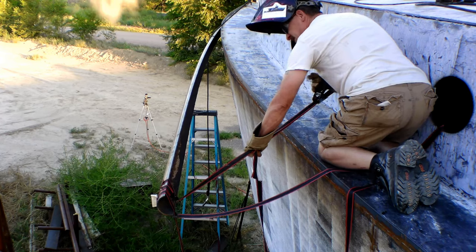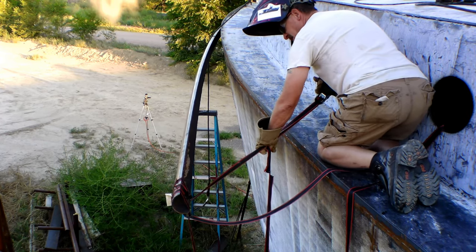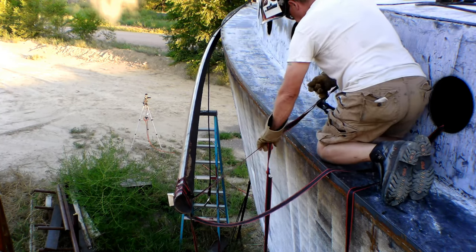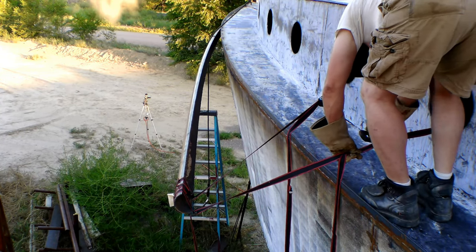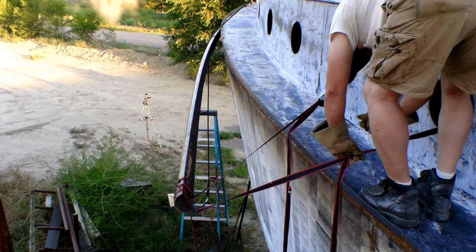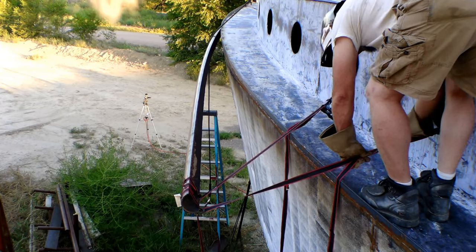What I ended up doing was tacking the forward end of the shear pipe to the bow, because that was going to be the worst part of the bend, so I wanted as much leverage to get around the bow curve as I could. Then I would slowly ratchet strap them in and tack it along the top and bottom of the pipe as I went back.